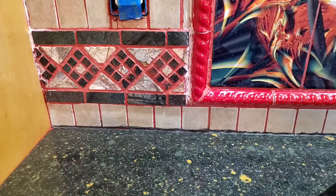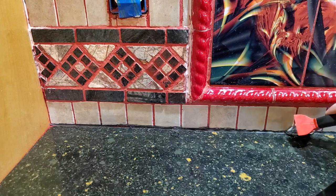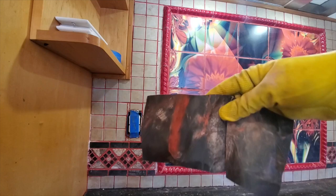Then I tried to remove the caulk and that was kind of a joke. I later learned there was about a quarter-inch gap between the countertop and the bottom of the tile, so most of the caulk was in that gap and it was really hard to get behind it to pull it out. I ended up getting a screwdriver behind it, which helped me pull it out along with scraping the bottom. As I was sanding, the grout continued to fall out and a lot of red dust came away very easily — very chalky. This is when I started getting really concerned that the brush or roller would pick up that red dust from the grout lines and turn the white paint pink.